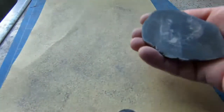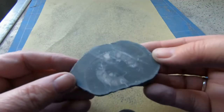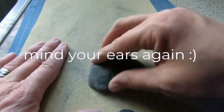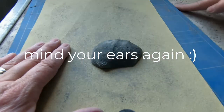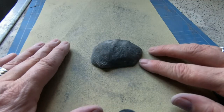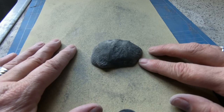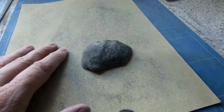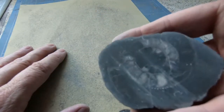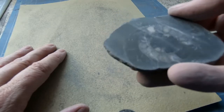Well, I'm still going with quite a coarse sandpaper. I don't know if you can see, but this strip here is getting there. We're nearly there with getting that one out. It's taken a long time of doing this business, but what you need to remember is also that this is producing a very fine dust again. So you have to make sure you're wearing a face mask. Goggles not quite so essential because you're not making this kick up in splinters. But definitely 100% a mask because of all the fine dust that you are producing with regards to sanding down this surface. Alrighty, so I'll be back in a minute, and well, a minute for you, probably less, but I'll be back when I've progressed some more.